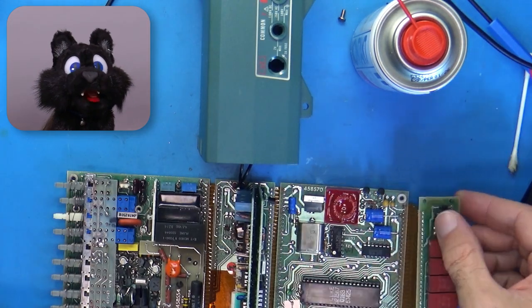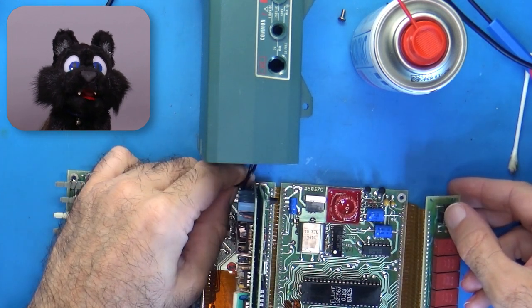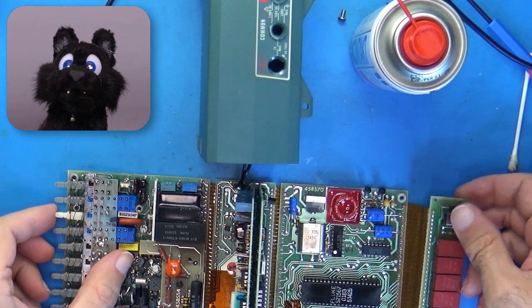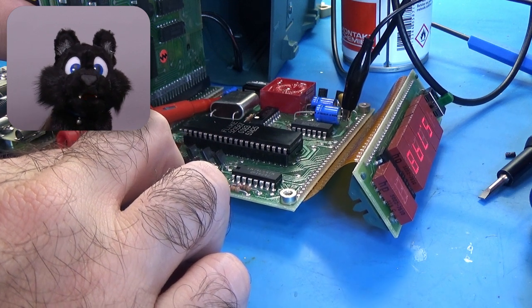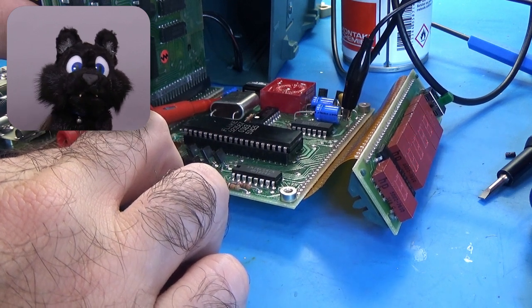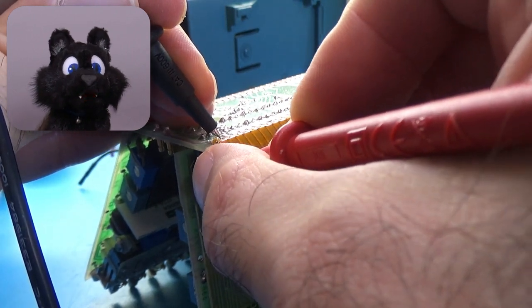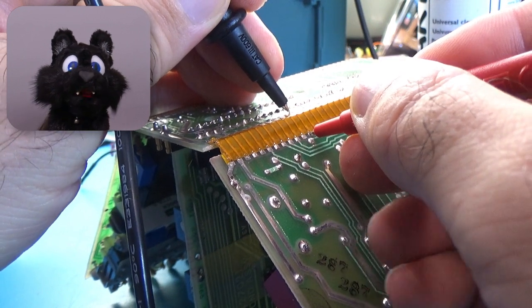Since I needed my lab power supply to provide some test voltages, I assembled the battery box next. But for some reason the meter wouldn't turn on — and then it would, and it wouldn't. A wonky connection somewhere! After much poking and prodding, I found out that one of the flat flex connections between the boards has bad traces, mostly the power lines.